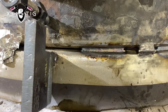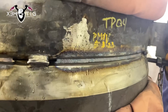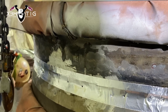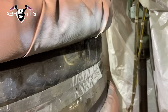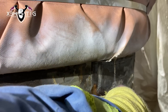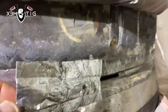The welding between the tacks is done. Now we're going to cut out the tacks and I'm going to put aluminum foil back around, drill a couple holes, and let it purge for maybe the next half hour. We grind everything — all the marks and dogs that were on the pipe, all tacks are cut out — and we grind all stop-starts. As you can see, the purge is still set at 60 liters.